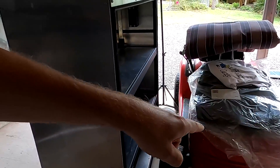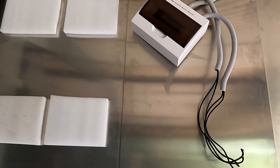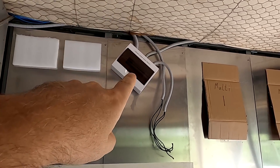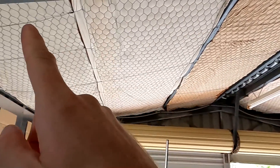Welcome back — it's already afternoon now. The lawn care took far longer than expected. I have already installed Multi-Plus number one and Multi-Plus number two. Here is our DC distribution with solar charge controllers and the switchboards with the incoming solar combiner boxes. I'm really thinking of getting that combiner box up on this wall as well, but that would mean extending all the string solar cables from strings one, two, and three all the way down to the combiner boxes — probably not a big problem but a lot of work.